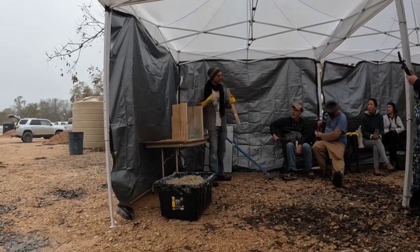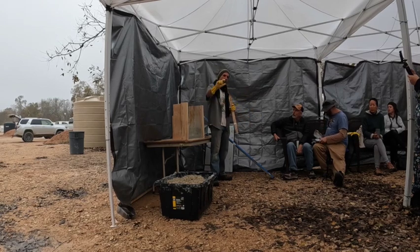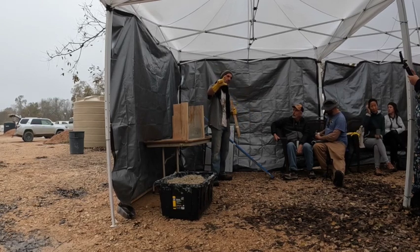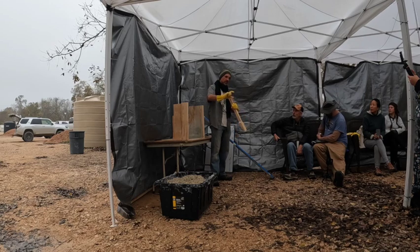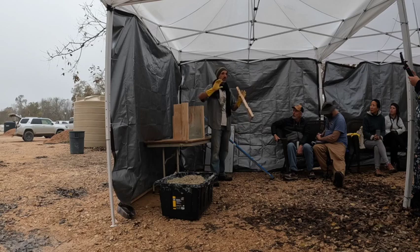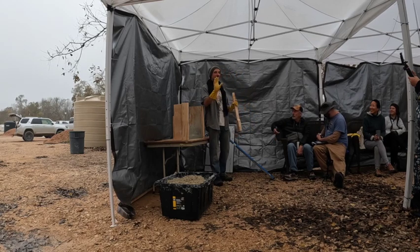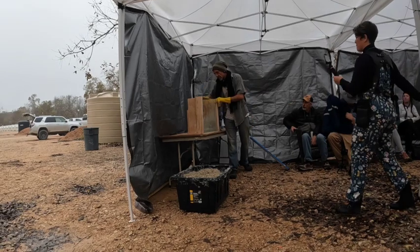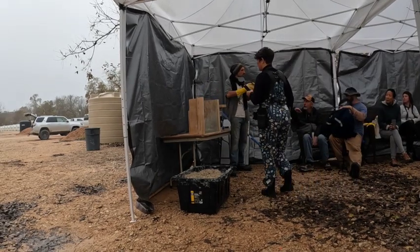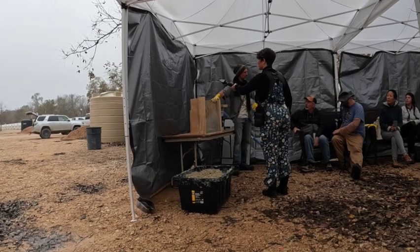What you want to see visually is when you put that layer of hempcrete in, a couple of inches thick, not 4 inches or 6 inches, just a couple of inches. If you're not sure what an inch looks like, there are tape measures here. Go check them out. The middle bit is almost like a key, the middle section. Come check it out.